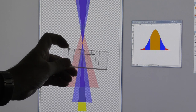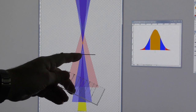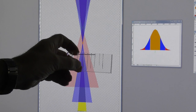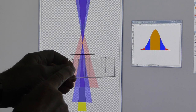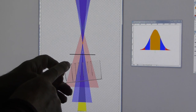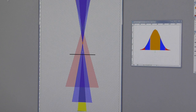which will be this conical mouth entry. But then the high intensity penetration caused by this very, very small footprint here will be equivalent to one of these. Remember, this was 4 seconds, 2 seconds, 1 second. Well, this is one of those 1 second penetrations where it just flies in parallel and deep. All the focal points are doing is defining the entry point of the beam at the surface of the material.